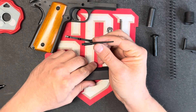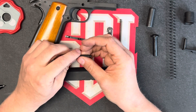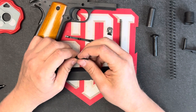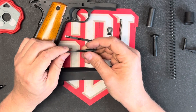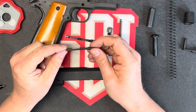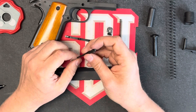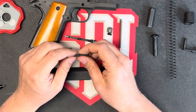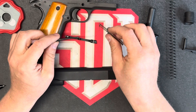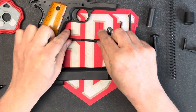You're not really going to see a lot of altering of the firing pin. You may see it swapped out with a different firing pin, like a titanium firing pin, but there shouldn't be a lot of alterations to the actual firing pin itself. There might be some wear and tear damage because as this strikes the primer with substantial force over time, the nose of the firing pin may start to mushroom down or shorten due to the force exerted. At that point you probably just need to replace the firing pin. This interacts with the hammer, the firing pin spring, and the cartridge. That is the three components and their critical dimensions and what they interact with.